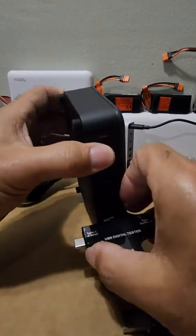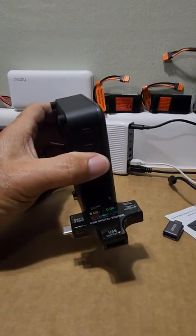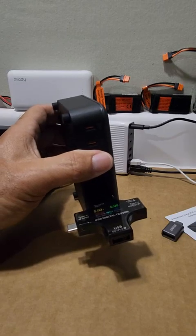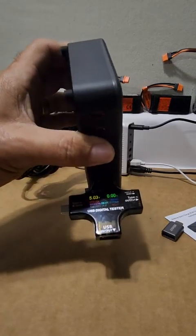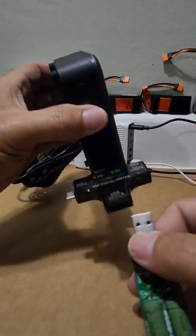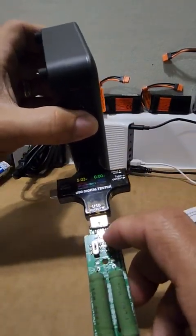All right, let's go ahead and hit the orange one, the Big Daddy. I'm gonna put a fan on, excuse the fan noise, but my load is gonna heat up, so I want to compensate for that by giving it a little airflow in between tests. All right, that port, the orange port. I'm not gonna test the second black port because it's gonna be identical to the one we just tested. Plug into here, of course, 5 volts as predicted.